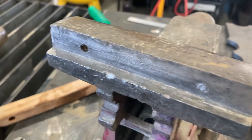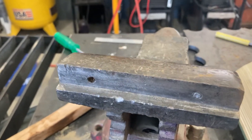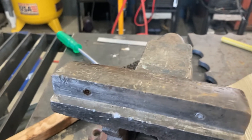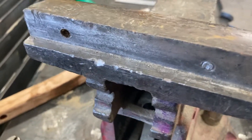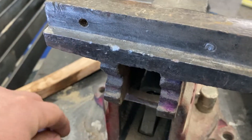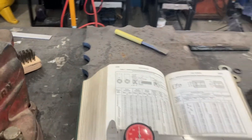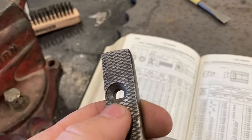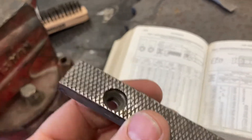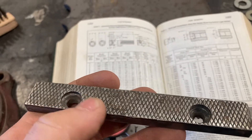I'm not going to use machine screws on this. I'm going to extract this one without damaging the threads. I don't really like machine screws as a preference — I prefer to use a socket head cap screw with an Allen key. I've consulted the Machinery's Handbook because this changes the way the removable section of the jaw works, since we have to put a counter-bore in to sink the socket head cap screw down far enough that it will seat below flush.